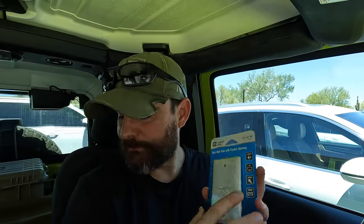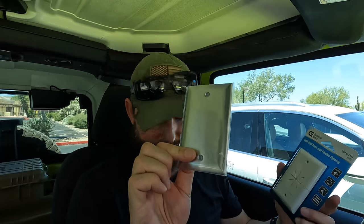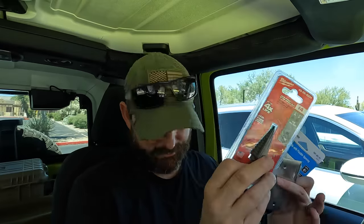That was almost like going to a gun store — a little kid in a candy store. I found a split wall plate that I hope will pass the two coax cables directly through from the garage side — no need to drill another plate. For the wall plate with the coax connector I decided to pick up a stainless steel wall plate. I'm going to drill it; I didn't have a step bit for metal so that was a good investment — almost 40 bucks, but worth it.